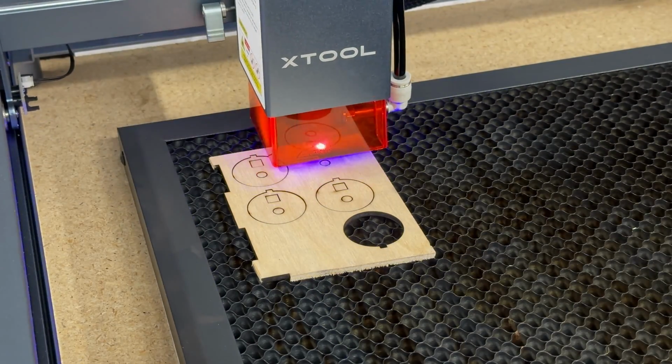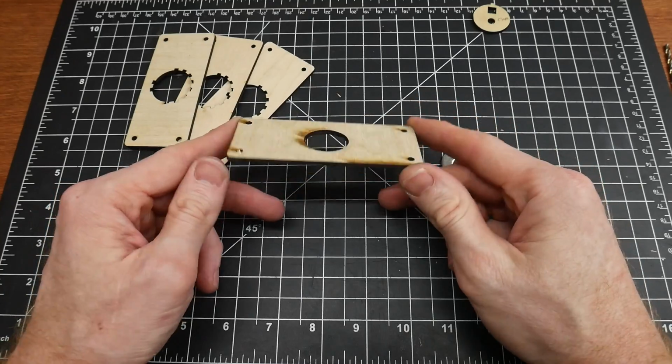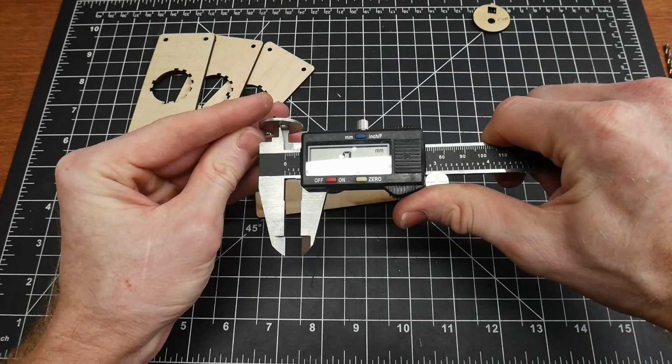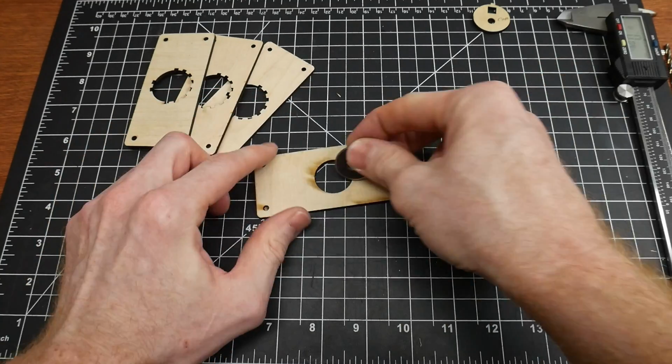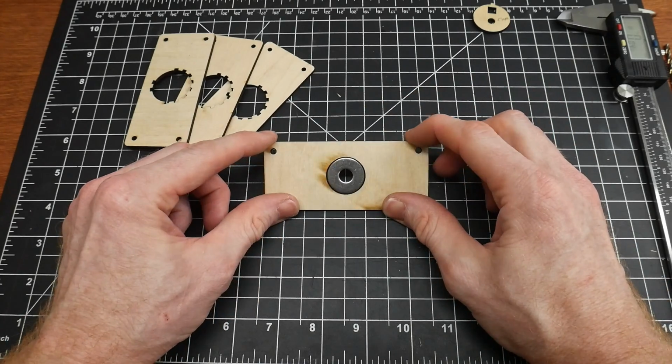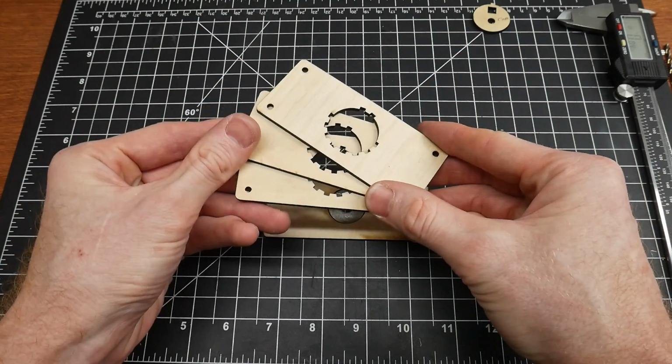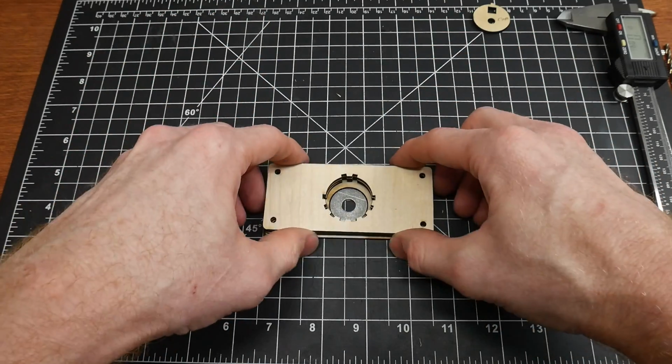The process here is pretty darn simple. You're going to need to cut out one base plate and 3 top plates, along with 5 rotating hub pieces. I designed this jig to have 1/8 of an inch mounting holes on all 4 corners and a number 7 drill sized hole through the center of the 5 hub pieces to be tapped with a 1/4 thread.